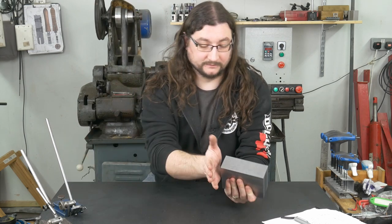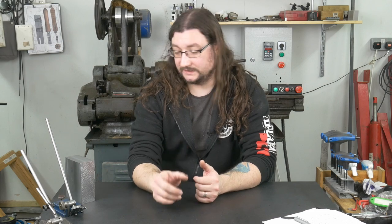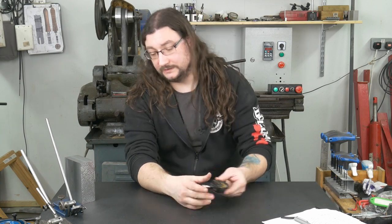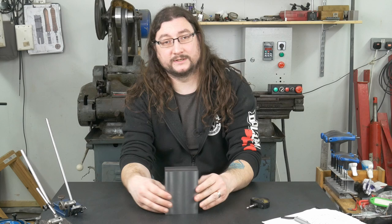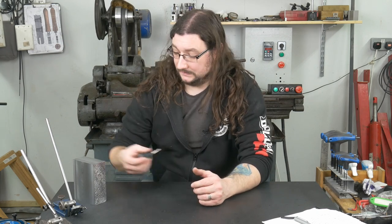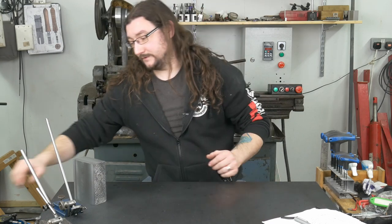Also the parts you're working on, just wipe them off by hand — you'll feel any bits of dirt, dust, anything like that. Make sure that your plate is clean. Ideally to take this kind of measurement we would want a hole in the surface plate, and through that would be inserted an indicator from underneath. Then you get the full contact on the face of the part to your plate, and the indicator will pick up any variance from flat. Now I don't have that kind of apparatus unfortunately, but we can approximate this with a couple of parallels.